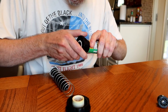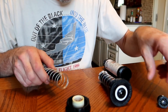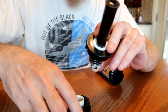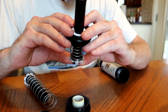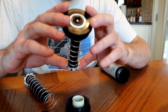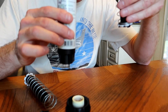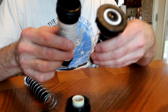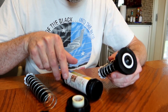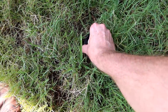So it's clear that this is the same piece. You pull off the cap and it's obvious that this piece broke off — this is all one piece on the new one and it's two pieces on the broken one. When the water turns back off, this thing snaps back shut and I think it just hit with such force it sheared the head off. This is really the only piece I need because I left the housing in the ground. Since it's the same part, I'll just replace this using the housing that's already in the ground — that'll work just fine. All I have to do is screw that thing back in there and we're back in business.